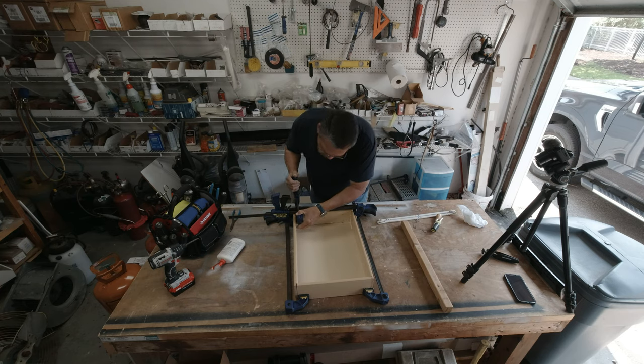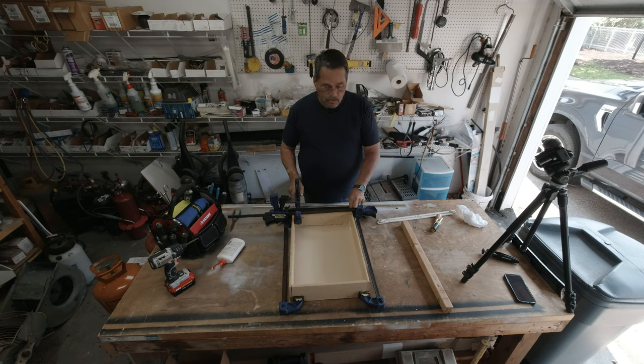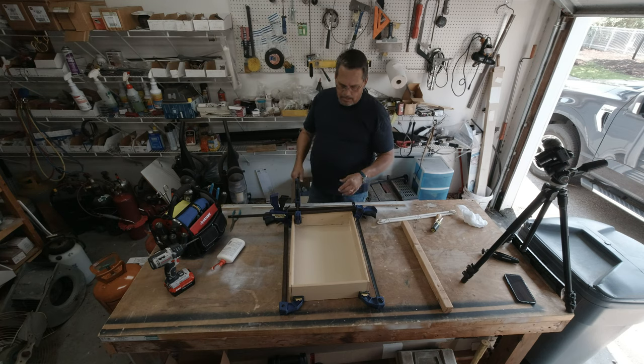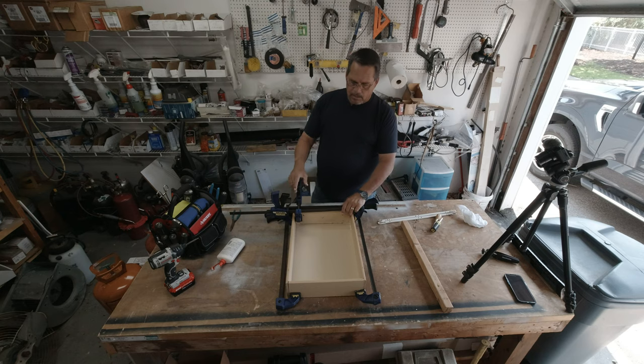This drawer has been brought in for me to do a repair on, to put back in this apartment — and this is the third drawer in this one unit. I'm not really too concerned about the inner looks of this. If you could come back, you could actually take that little flap off, put some wood filler in there, fill it up. When it's dry, sand it flat. I have a paint that's pretty close to the original cabinet color, and we just paint the inside of the boxes pretty much every time we get the apartment ready for somebody to move into.